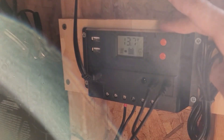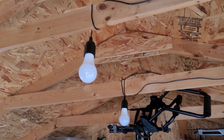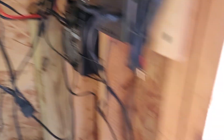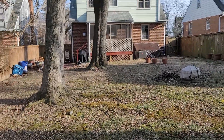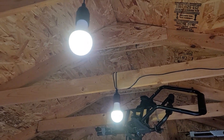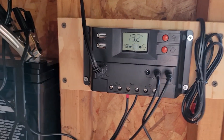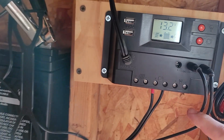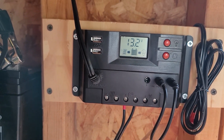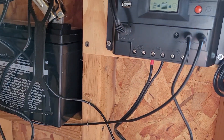From there, you can do all kinds of interesting things with this controller. One of the biggest reasons I got it is these lights here — because I often go to the shed when it's dark and this is where I keep my toolbox. I didn't want to dig a huge trench all the way back to the house and mess with the breaker panel, so I power the lights through solar. The controller also lets you charge your phone, power lights, and anything that can take 12 volts can be powered off of it, drawing power from this battery as long as it has enough juice.